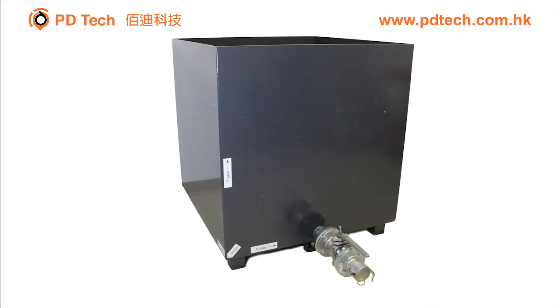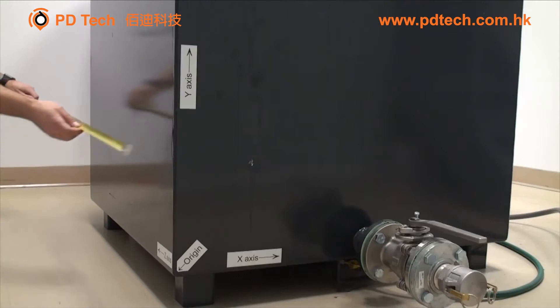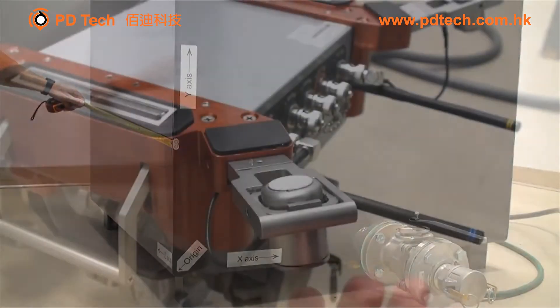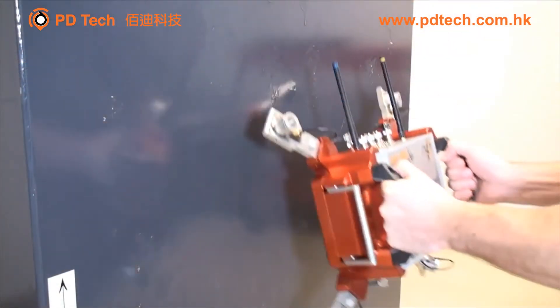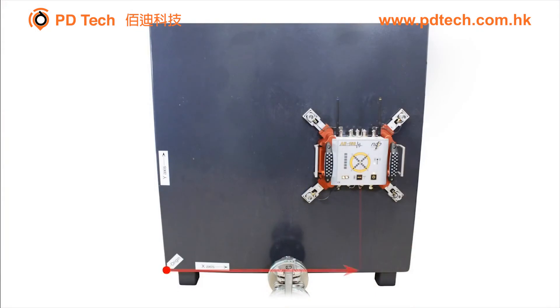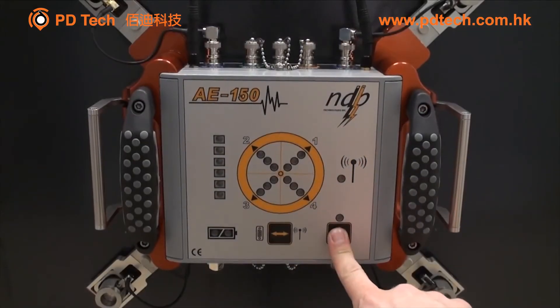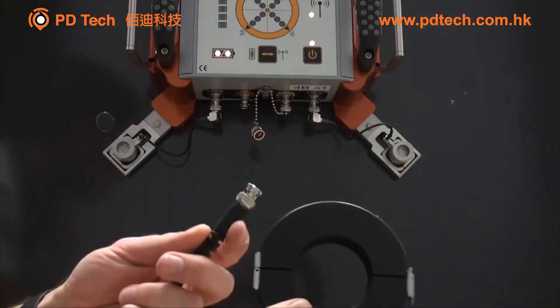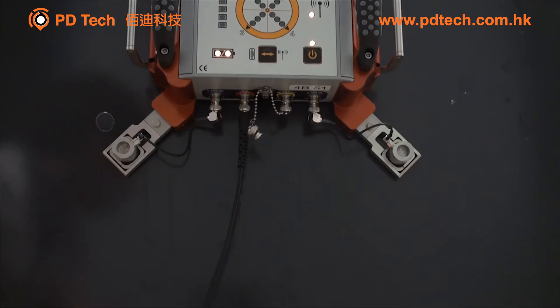For the sake of this video, a demo tank will be used. One of the first steps requires identifying an origin point on the tank with X, Y, and Z axis. Refer to the transformer schematics or use a measuring tape to get the tank dimensions and keep the values for later. Apply a thin layer of acoustic couplant on all four acoustic sensors. Mount the AE-150 on the tank and press each acoustic sensor to ensure optimal contact. Measure the location of the instrument on the tank from the point of origin and keep the values for later. Turn on the instrument.